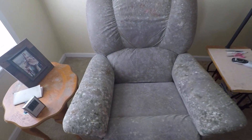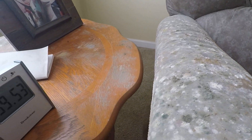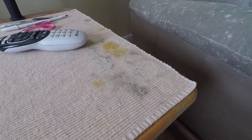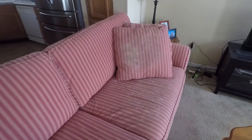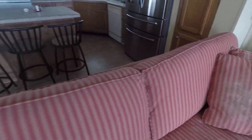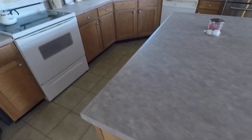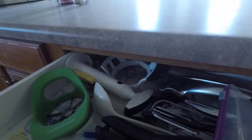So these are the recliners and mold just grows on everything. This is three months of leaving that thermostat fan on run instead of auto. It grows on the fabrics first because those materials acclimate themselves to the humidity faster. But then it grows on the surfaces of cabinetry — even grows in the drawers.